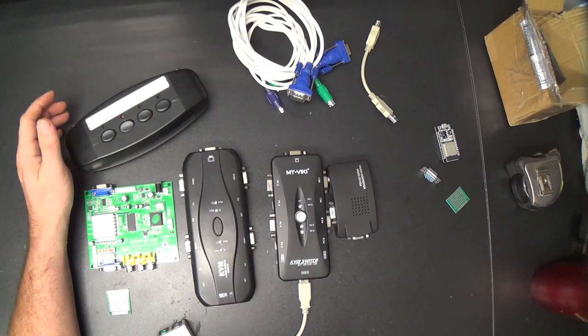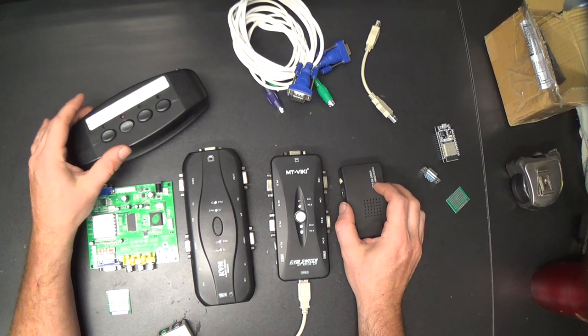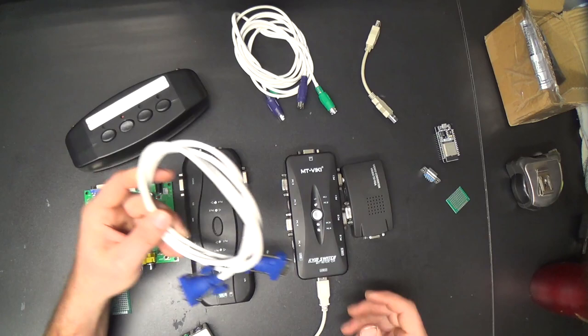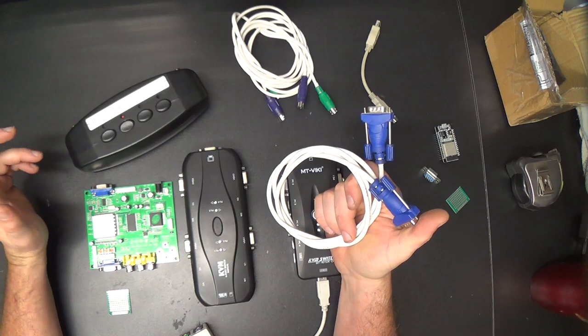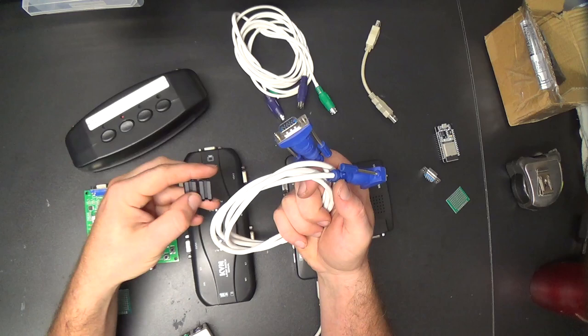Anyway, supposedly the same is true of PS2 ports. You're not supposed to hot swap PS2 stuff either. Now, I've done that a whole lot more than I've hot swapped ADB stuff, and I've also never had a problem with that. But I tried testing a bunch of this stuff, see, and you of course have great big long runs of cable between these different KVM switches and all this, so you end up with like 70 miles of cable between the actual computer and the actual monitor, and all of these boxes in between and stuff like that. The long story short is the video signal picks up a lot of noise going through all this, and you can see it, and it's not cool. Now I've got some little snap-on RF chokes, that one's too small, but I've got a bunch of different sizes.